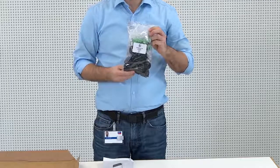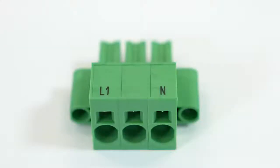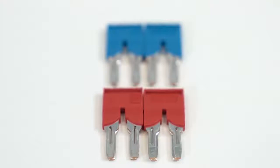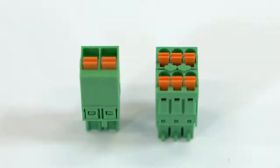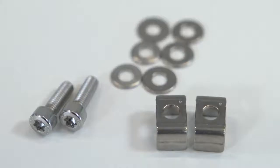Also, this is a bag with all the parts that will be used to complete the installation. This is the AC terminal plug for the connection to the public grid. This is the AC terminal plug for the secure power supply. These are the jumpers for the DC terminal connections. Here we have the three interface plugs for battery communication. On the left, we have the interface plug for the connection of the switch for the secure power supply. On the right, the communication plug for the optional battery backup box. And also, the components to use the optional PE connection if required by local standards.